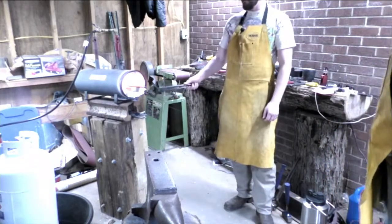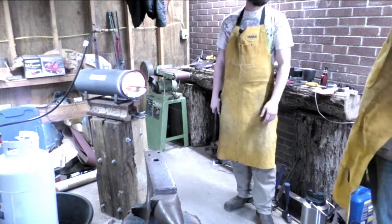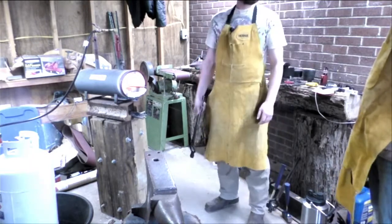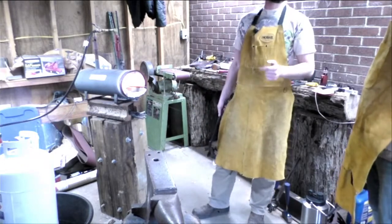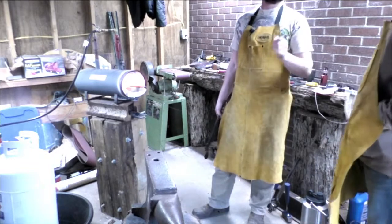Near the end of this thing's life cycle, after we do a quench, we go to the oven, we bake it. So, yeah, baking knives. That's hardly done. It takes a while, because when you quench it, it becomes extremely fragile. It's super hard. What this is doing is easing that into a nice Rockwell where it's going to be strong, yet flexible. Gotcha.